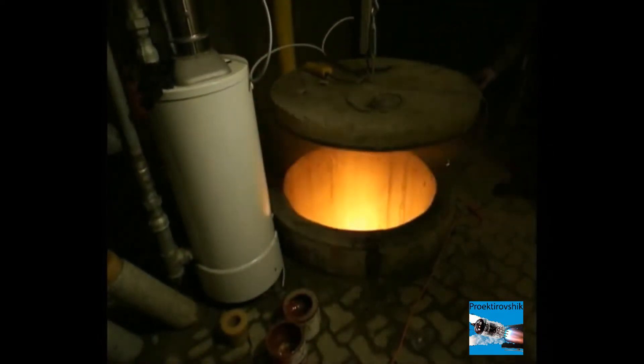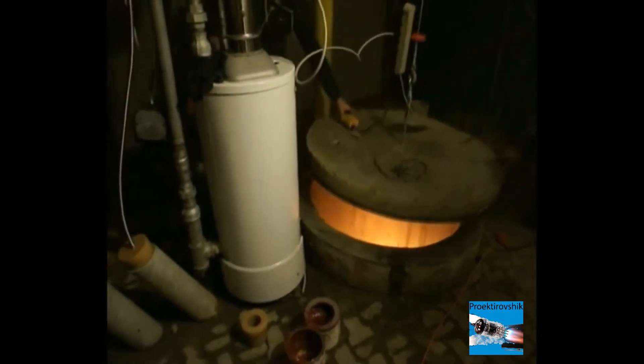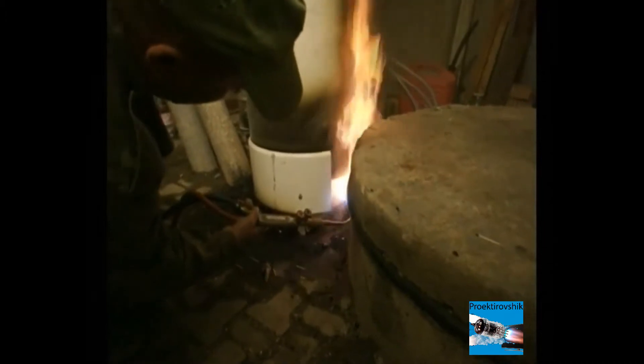Now I will point out the advantages and disadvantages of the shaft based on my theoretical and practical experience. I respect the author's bravery to place an updraft coal gasifier in the ground around the neighbors. Usually such gasifiers were made of iron with liners to protect them from burnout and corrosion by acids. The outlet pipes were also lined, as they didn't last long due to a whole set of acids. The author should not have spent money on heat-resistant stainless steel at the top of the shaft — there will be nothing left of it, and it will happen faster than assumed.